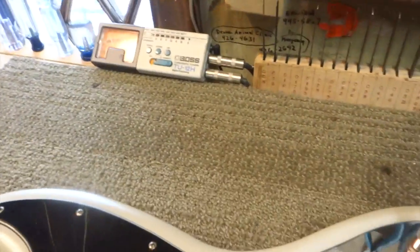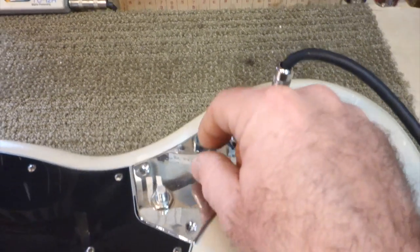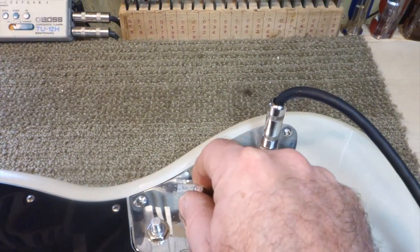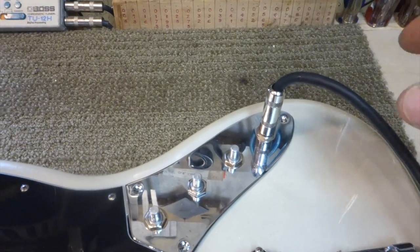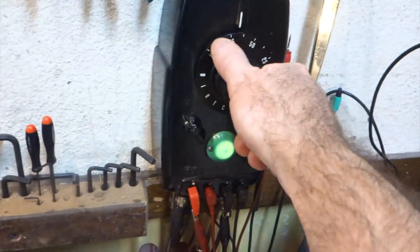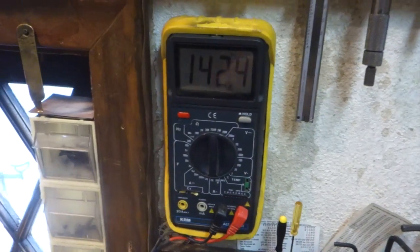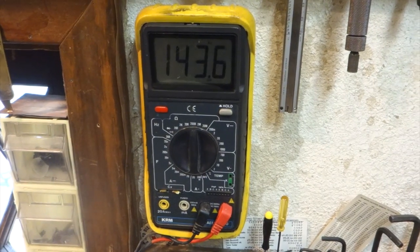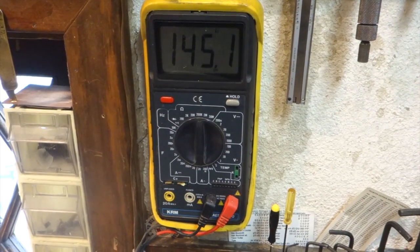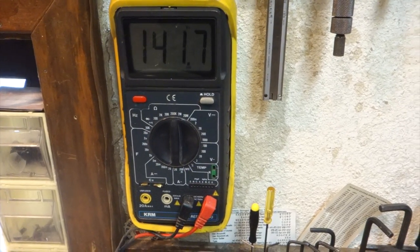Now in cases like this, where I'm having some problems — it's cutting out, I'm getting that bad signal — this is where the switch box can really come in handy. Because now I can immediately switch, without touching anything, from that quarter-inch over to the meter. And now I can see that I obviously have an open circuit rather than a short. That really streamlines the troubleshooting before even taking the instrument apart.